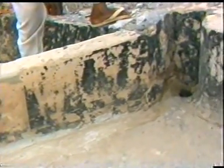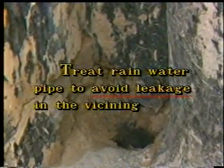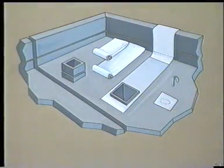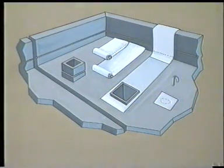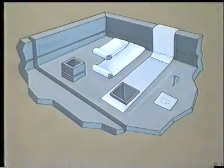The area around the rainwater pipe outlet is treated with special care to avoid any leakage around the rainwater pipe. The area is thoroughly cleaned, coated with polymeric bitumen primer, and a Multiplus sheet is cut to cover the area around the rainwater pipe. The sheet and applied primer coats are heated and pressed for proper fusion and a waterproof outlet in the usual manner.